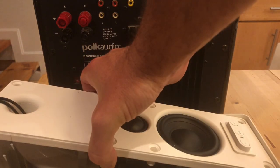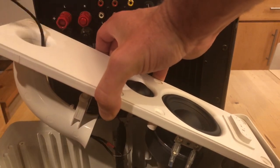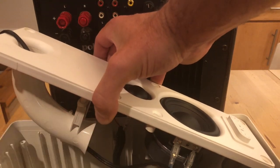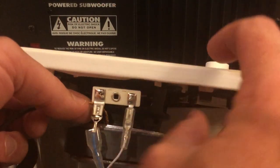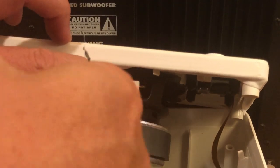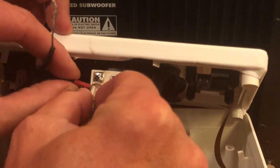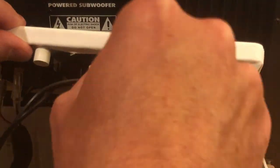The quick and dirty way to do this is I just fed the speaker wires through the port as a temporary solution. Here's my theory: inside the Sonos, there is an electronic crossover that divides the full-range signal into a signal for the woofer and the tweeter. That signal from the woofer goes into its own amplifier, because this is a bi-amplified speaker. If we get that amplified signal from where the woofer connects and send it into the speaker-level inputs on our sub, we can essentially feed a signal to the sub and have it working as part of the Sonos system.